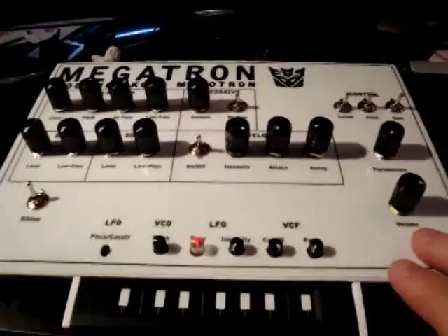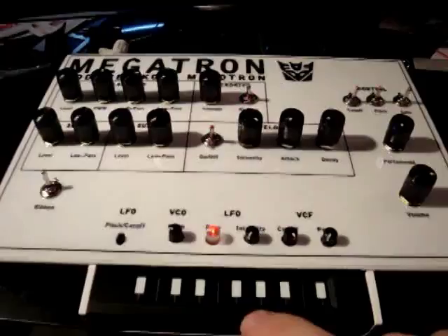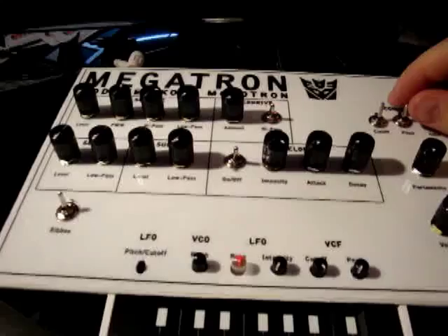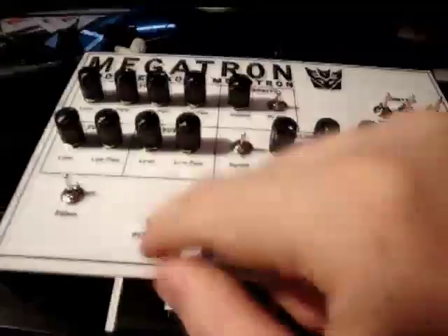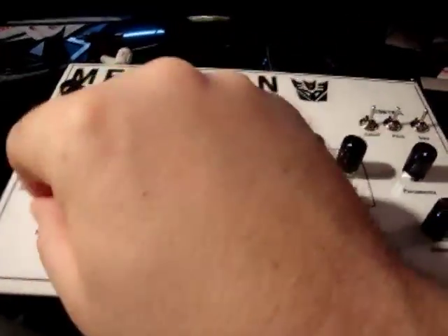The first thing I added was MIDI control. Part of doing that was removing a resistor that the ribbon needs to get on and off. I switch everything to MIDI, and when I want to set the ribbon off, I just flick the switch and it removes that resistor. When I turn it back on, it switches the resistor back into place.